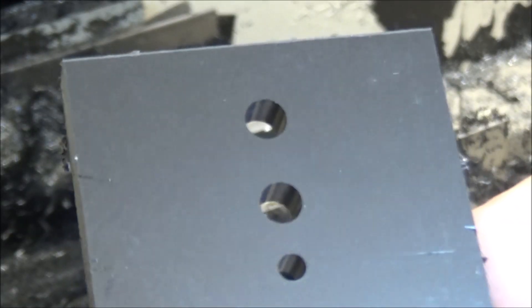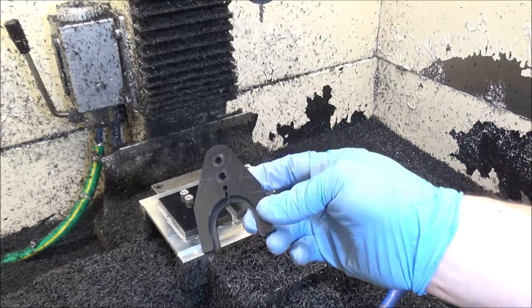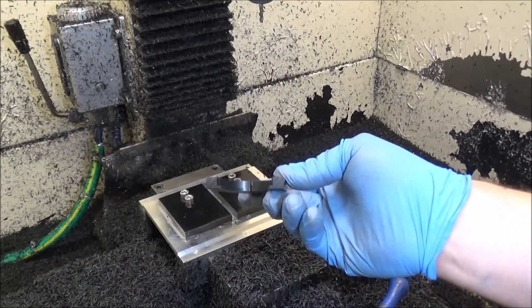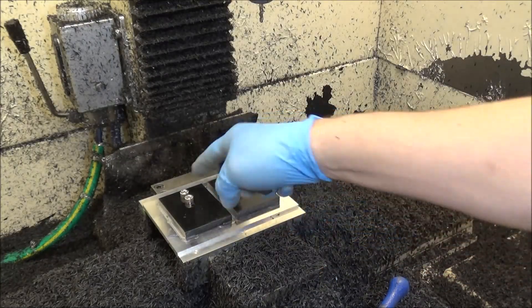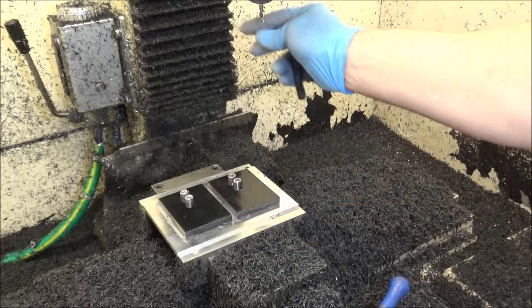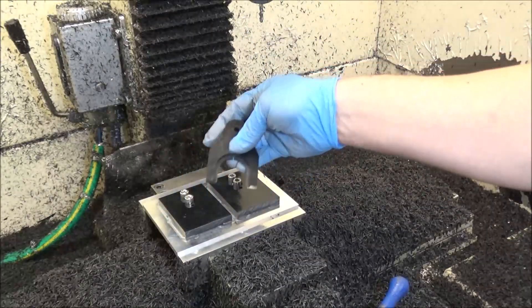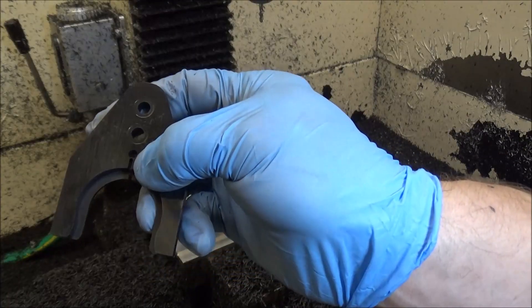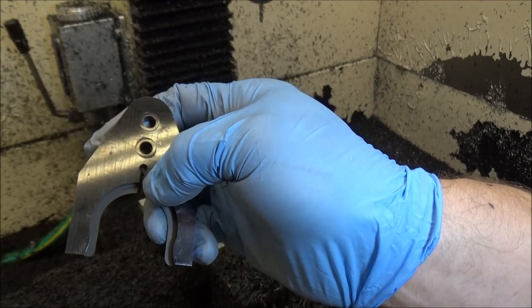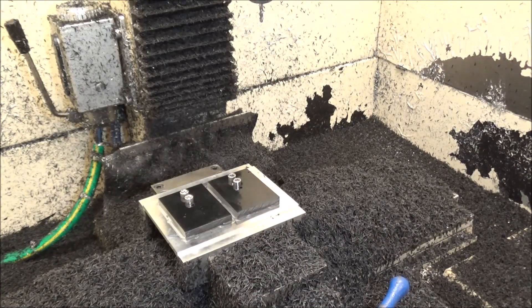It does a really good job on this plastic. The next operation is just to machine the profile of the tool forks — two different operations. First we'll use a three-sixteenths inch three-flute end mill and do most of it, then we're going to come back with a small end mill to get this little groove or slot right here. This is a sixteenth inch end mill.